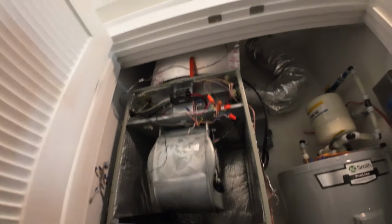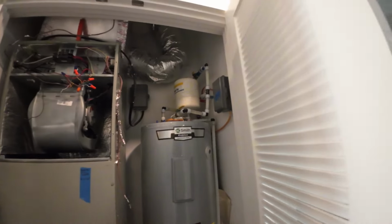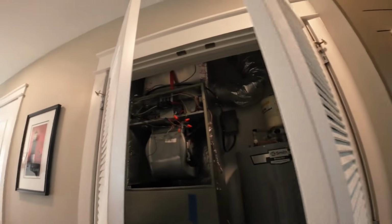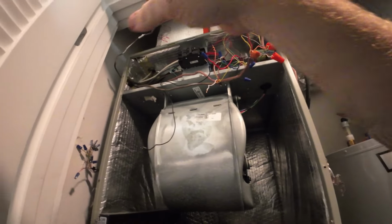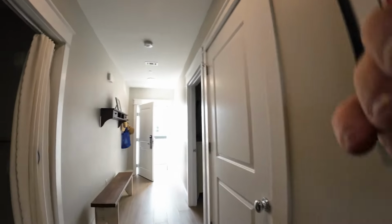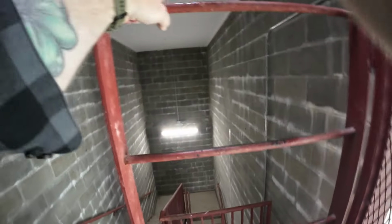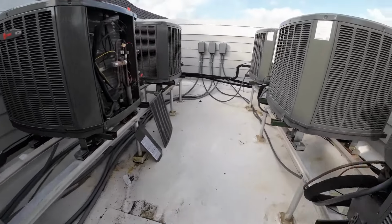Now we're going to go back to the roof, and we're going to ohm out the pairs and then ohm out to each other and see what's bleeding over. We can isolate this thing to the outside. If everything ohms fine, then you know this wire going to the condenser is good and your issue's inside somewhere. Now sometimes it might take a little bit longer to do it this way, but it'll actually save you time in the end run instead of chasing a short and racking your brain. This is like the surefire test, just to test the wire itself and know that it's good.